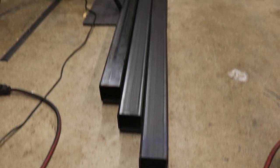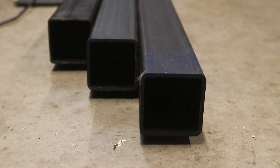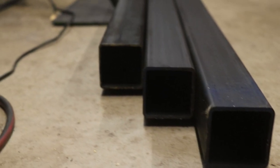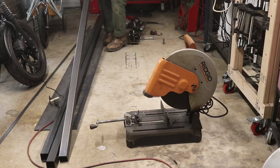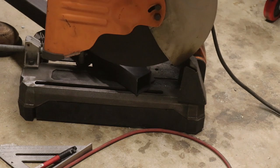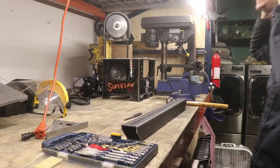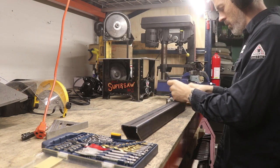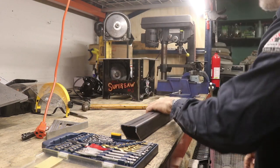To do it, we've got some 2x2 square tubing here — a bunch of that. We've got some in 11-gauge wall and some in 14-gauge wall. I'm using my trusty abrasive saw to cut some 45-degree ends on these tubes. This is going to form the base of my cart. I'm going to drill some holes in here as well so that I can thread on some caster wheels.